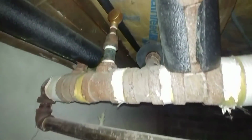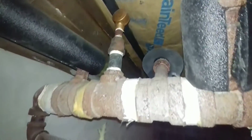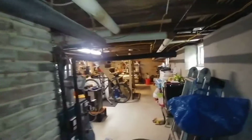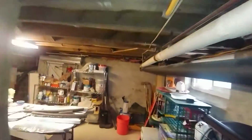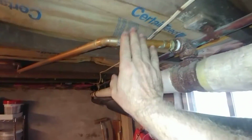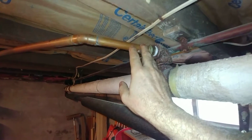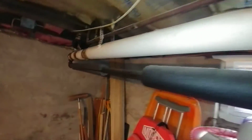And there's the piping going to the front. And yeah, we just have a Gorton #1 there at the front. It's a very nice vent. And let's see, let's go back here. Oh yeah, this is feeding the bathroom, and this is way undersized, so we're eventually going to change this out to 1-inch steel.